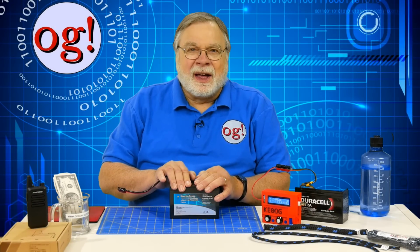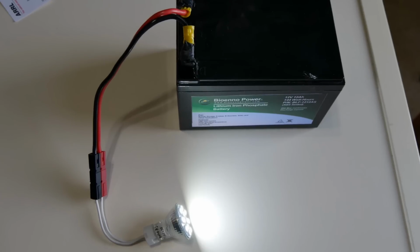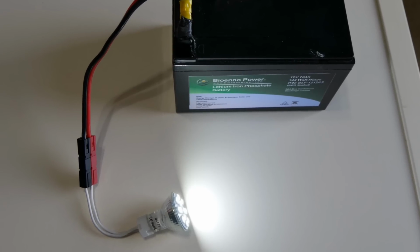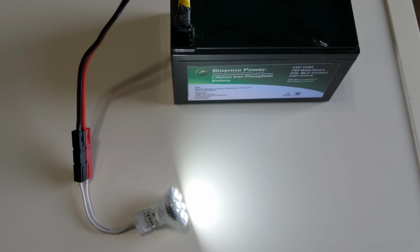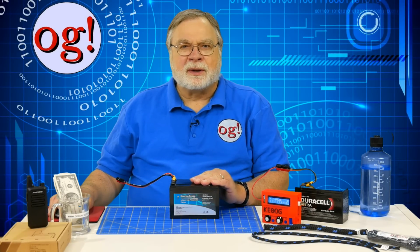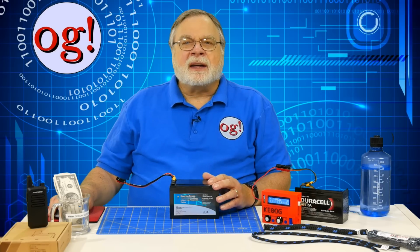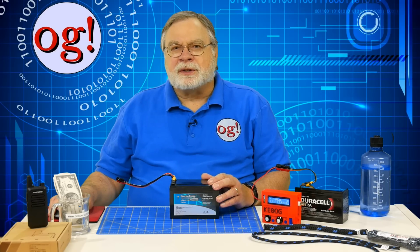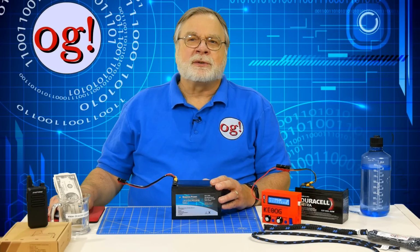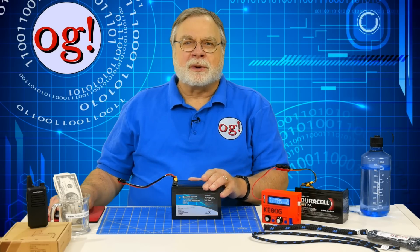It's cool. I did an experiment with the battery. With portable operation in mind, I plugged in this little LED light designed to take 12 volts at 120 milliamps. Then I just left it on. I noted that the battery tends to run in the low 13 volt range while discharging, a volt higher than the discharging lead-acid cell. I kept wondering if it would ever slow down, but it took 4+ days of 24-hour operation to bring the voltage down to 12.5 volts. At that point, I thought it wise to terminate.